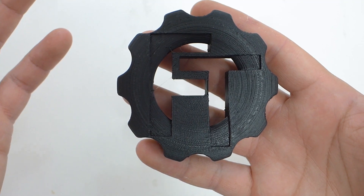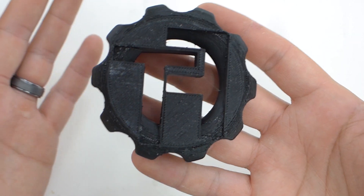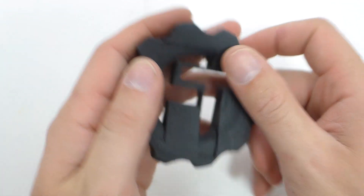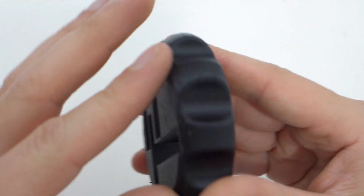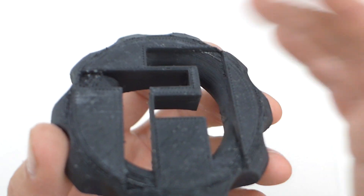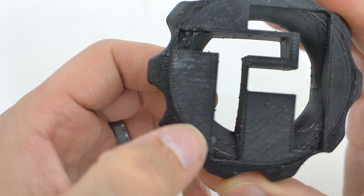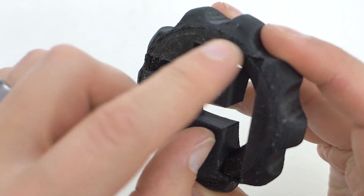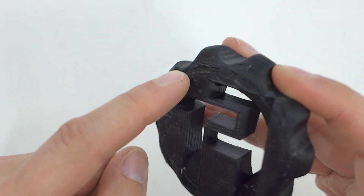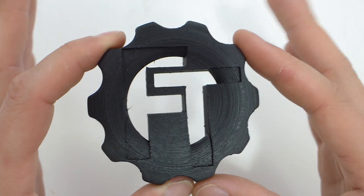Finally, here's the APLA Plus. This was about a 30 gram segment as well; I only had about two feet left after printing so I just threw it away. This was also the first filament I printed, and it came out fantastic — great filament. Just two little strings, no pimpling, no bubbling, no real under-extrusion. Side walls were great. The bottom layer was a little bit too far away from the bed, which was sad to see — this was printed on the FT-2020 i3 while the other three were on the FT5. The overhang layers didn't all adhere perfectly at the extreme fan-out, but the top finish was crisp and clean. Really nice results overall.